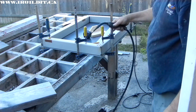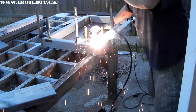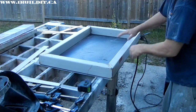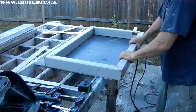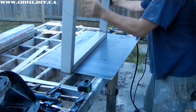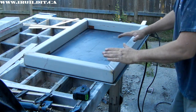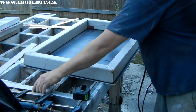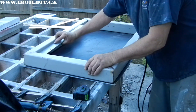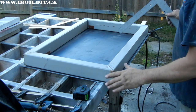I'm just using flux core wire, 35 thousandths. That's the subframe tacked together on this side. I'm just going to flip it over and tack it on the other side. I'm going to take the time now to check it to make sure that it's still flat and square — my square on the inside here. This doesn't have to be perfect.